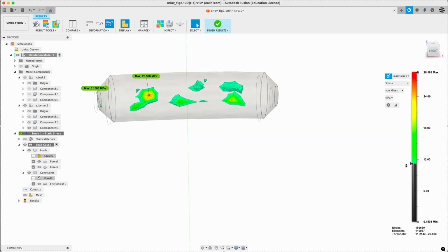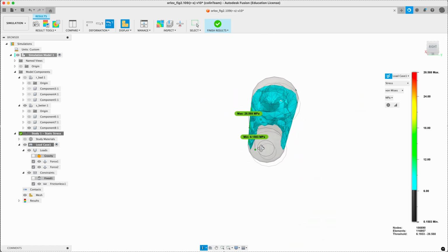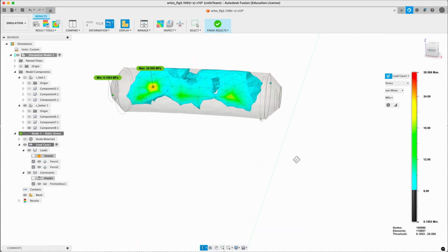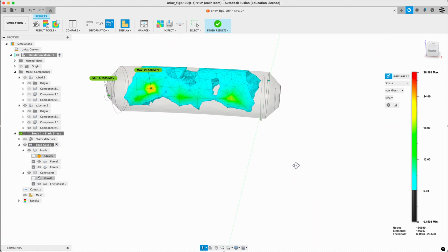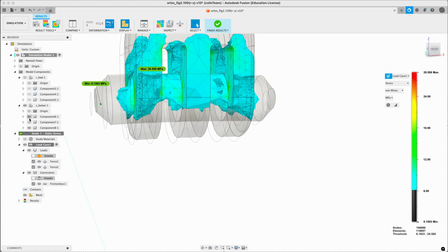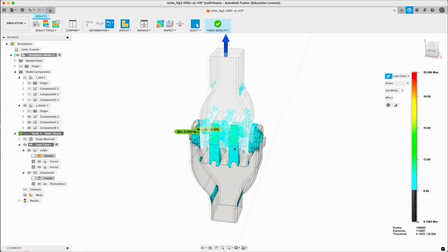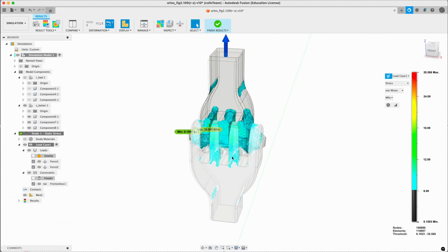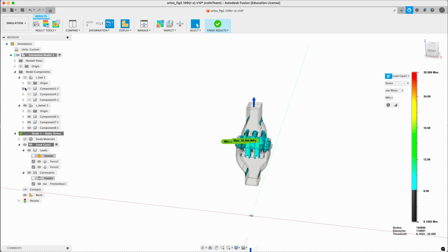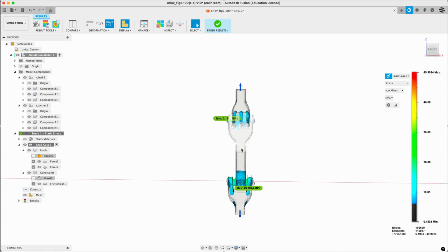Let's see if we develop any typical bending. A little bit side to side, but it's all on one side. So this is more just, looks like tension or compression, crushing or stretching. So what is it? Let's see. Load's pulling up. It's crushing from these two forks in the middle here. So it's trying to bend, but it's been resisted. So we've removed the bending here. Nice job, and ended up with quite a bit less stress in the top.